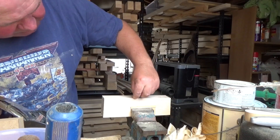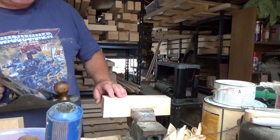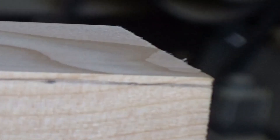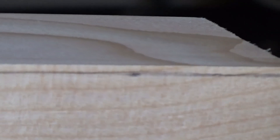I've got a bit of planing to do. I've got a pencil line there and one on the other side and one on both ends that I've got to get down to. You can faintly see that pencil line — that dot — that's what I'm working down to. I'm taking thinner shavings now. I'm really pleased; it's remarkably parallel, which I guess is what a plane's for. The only thing I've had to worry about is whether it dishes or humps in the middle, and I think I'm being fairly careful with that. The lines on either end are telling me it's working okay. I'm going to get to the pencil line or maybe just above it, then I'll start checking with the calipers, because I really don't want to go under.